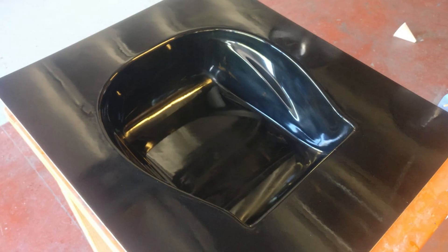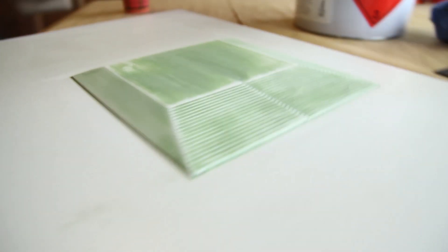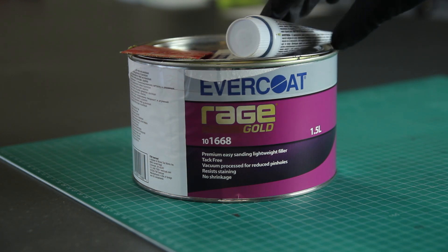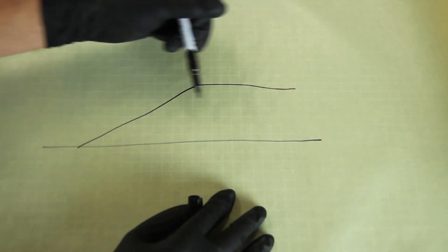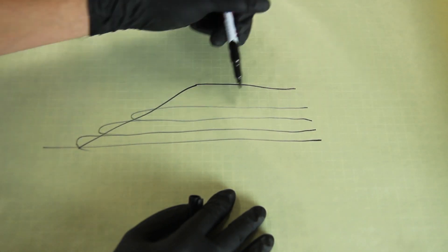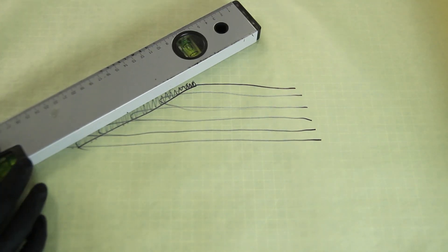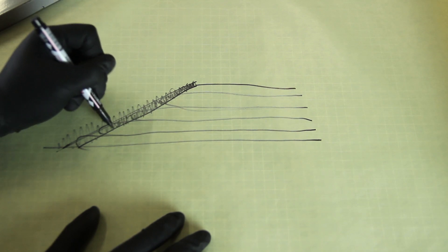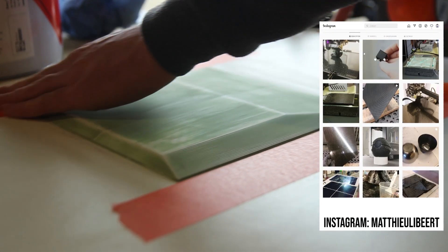As you can see here, all the finishes and the mold process is identical to the one in this tutorial. The part was 3D printed in two parts, glued together, and then bondo was used to finish the edges. This was printed at a 0.2 layer height, and if you 3D print, you know you'll get layer lines causing little edges. We just add some bondo and flatten everything back again. This first step is off camera, but you should be able to understand the process.